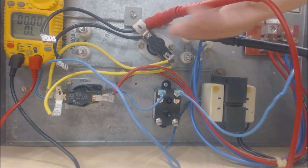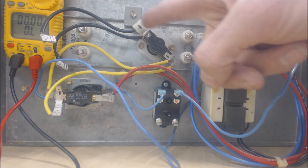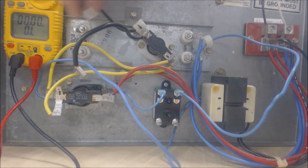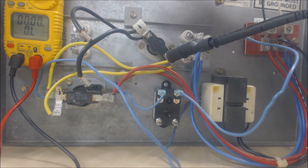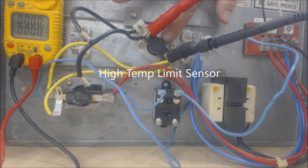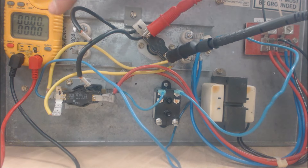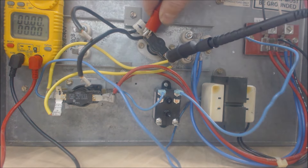We can also check the thermal limit. This side is disconnected, so we'll check the resistance value across the first set. This will tell us if we have a normally closed circuit or if the thermal cutout is open — maybe it just wore out. Checking it now: it is completely closed, zero ohms of resistance to electrical flow, which is good.